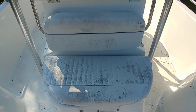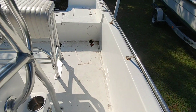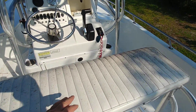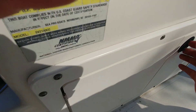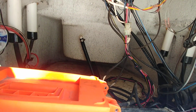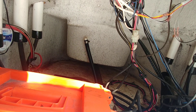Before I move to the back of the vessel — your center console seating. Overall, the cushions are in nice shape, just weathered. Keep in mind, it's a 2012 motor with only 428 hours on it — that's a big bonus here. You also have pedestal access and pedestal up front. This is where the batteries were — the seller took them out. I only see a bracket for one, though I doubt that's just a 12-volt trolling motor — it would have to be at least 24-volt.